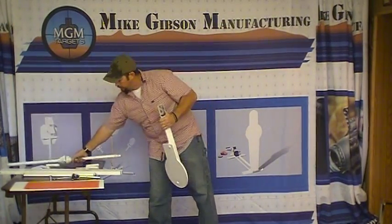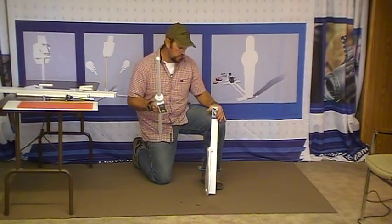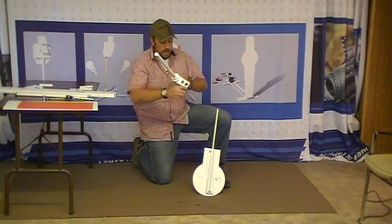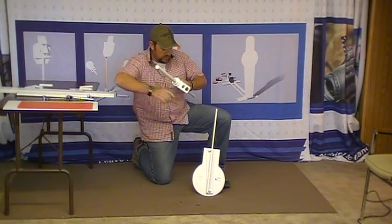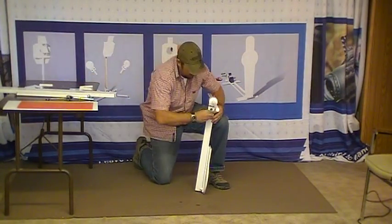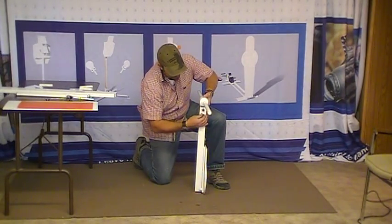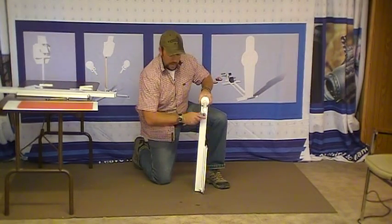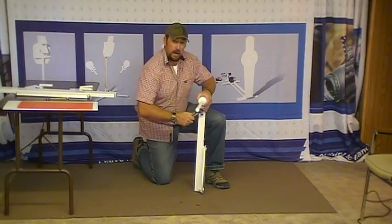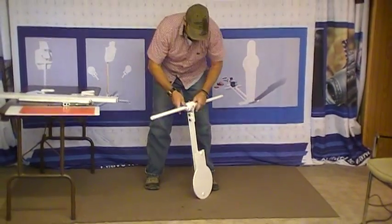To start off, you want to take the side that's unpainted on the target and the side that's unpainted on the horizontal shaft, and those two will want to match up. You'll notice on the horizontal shaft the holes in this are oblong. The reason for that is so you can put the carriage bolt in there and it won't spin, so you'll only need one wrench for this. Put those together. When you get this snugged down, go ahead and tighten it up as much as you can. The reason there's no paint on there is because after time, if you get these as tight as you can and shoot it for a while, the paint will actually start to chip away and these nuts will loosen up. If you have a torque wrench, you want to do them to about 120 foot-pounds. If you don't, just use a 10-inch or 12-inch crescent or end wrench and get them as tight as you can. No hand tools are going to be able to strip this out.